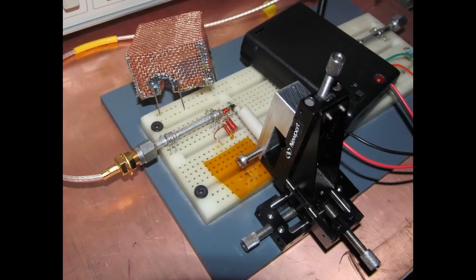So this is looking at the new oscillator assembled. I've got the cover pulled off right now just to take the photograph. There's a large square piece of Kapton tape. I ended up running the wires underneath the shield for the power and the return path, and I ran those up to the bus bars so the battery pack could actually plug into the bus bars. And those wires have no insulation on them, so that Kapton just provides that insulation barrier from essentially shorting the power supply up to the shield.